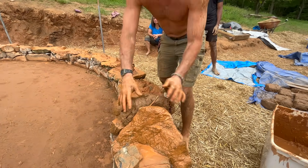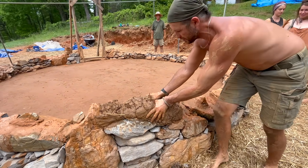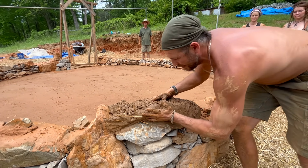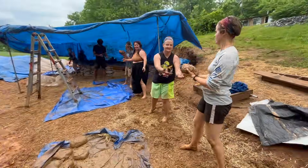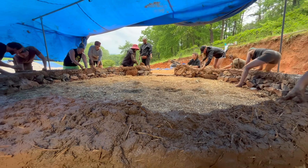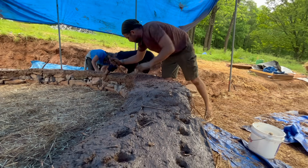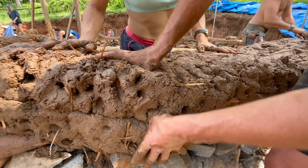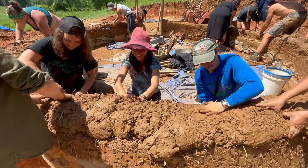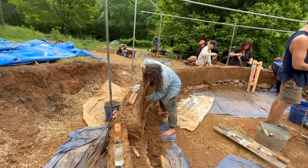We apply clay slip to the top of the foundation, and then begin building our walls by laying cob loaves down and sewing through the mix with our hands to create a monolithic mass. You first want to get rid of any seams in the wall, and then work on getting to your desired shape. To transport the cob to the building site, we make a line and toss the cob to one another. We work as a team to continue integrating and shaping the mix, with the goal of creating a singular monolithic mass with no seams, using a tool called a cobber's thumb to sew through the mix and integrate the layers. As we build up more layers, we integrate into the layer below, and once there is a significant layer of cob on the wall, we use levels and saws to trim it into our desired shape.